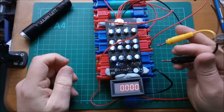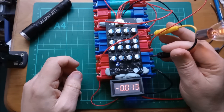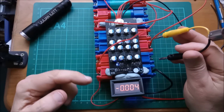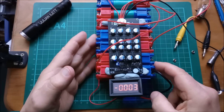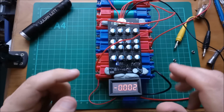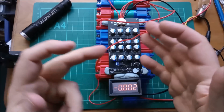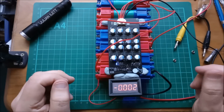If I place it on these two cells we see a negative current — and that's why I bought this bi-directional ammeter, because the currents flowing in the wires of this balancer will sometimes be positive and sometimes negative. That's essentially what I wanted to do today. What I really want now is five meters, one in each of these balancer wires, so we can see when a cell goes out of balance. Maybe I wouldn't need all five, but I'd like to start with that and then work backwards to fewer ammeters once I work out which ones are important.